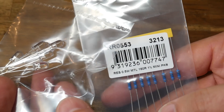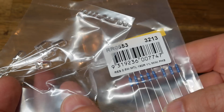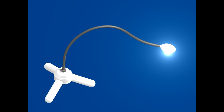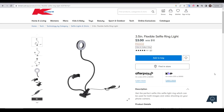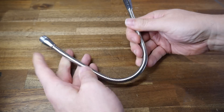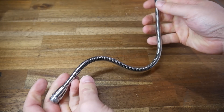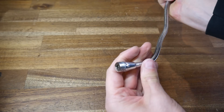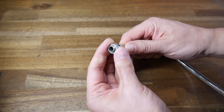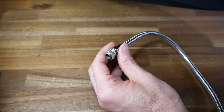The original used a small incandescent bulb, but I'm going to use compact and efficient 5mm LEDs — 6 in parallel, with a 160 ohm resistor, to suit the 3.7V nominal voltage. To hold this together I'm going to use random screws I have in my spares tray. That just leaves the flexible gooseneck. It's very easy to buy a product with a gooseneck to extract — just search for a flexible light. I went for a gooseneck I had pulled out of a lamp some years ago. It was a little shorter than I wanted, but it had a large thread I could measure and model around on one side, and the other side already had a nut I could trap inside a printed part.